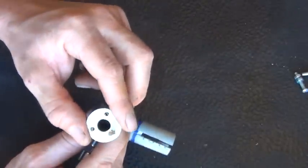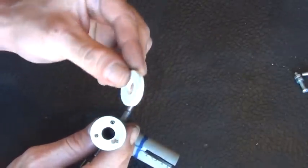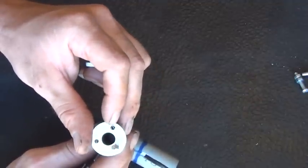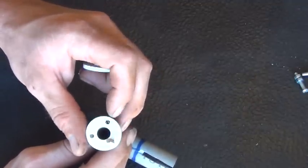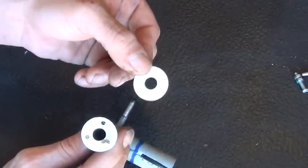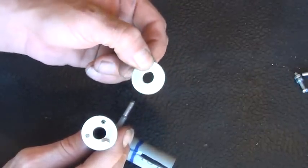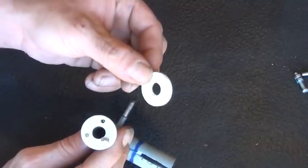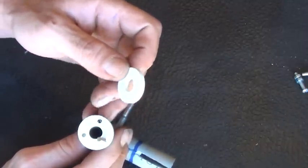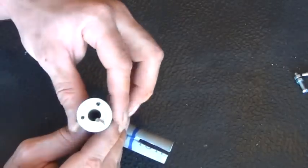So we'll mount the mirror in the center of this ring and be able to adjust our mirrors just slightly with elongated or oblonged holes. These three holes that you see going through there, we'll oblong those just slightly if we need to. That way we can adjust the mirror, do a little pitch because it's slightly compressible. We can adjust the pitch by increasing the torque down on one of our bolts. We'll be able to change and direct our mirror here.